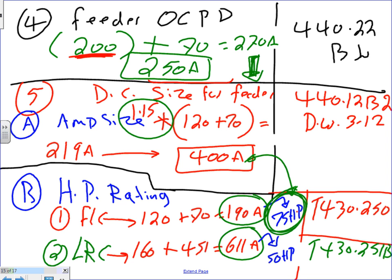But they have to be related to each other, doing some processing. Yes, absolutely, because you can't work on the conveyor if one motor is rotating. You're absolutely right, but that's where the functional association is. But I have an air handling unit here and an air handling unit here, guys. They're completely separate units. They're fed from two different separate branch circuits. You don't put a feeder disconnect on them. One for each.